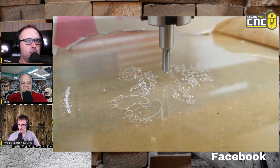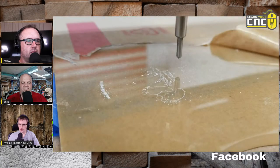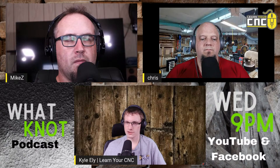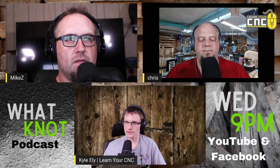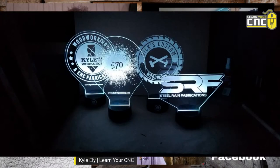I actually outlined everything at first, but when I did it again I filled in all the outlines with a fill because it was really hard to see them after I did it that way. The nice thing about drag bits is you're just scratching the surface — the router spindle is not spinning. So it's pretty quiet and you don't need to have your spindle running while it's going.